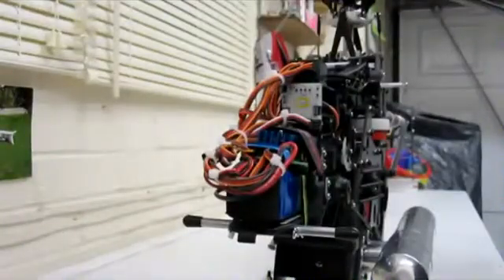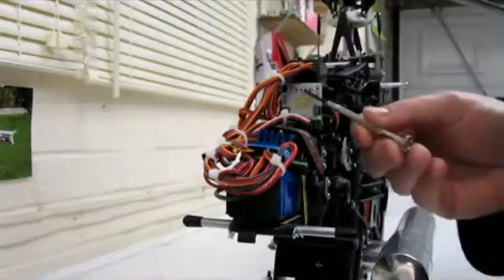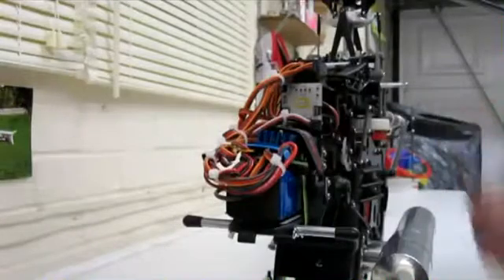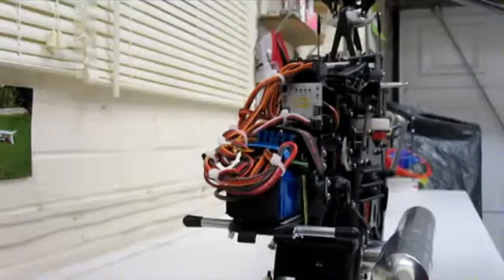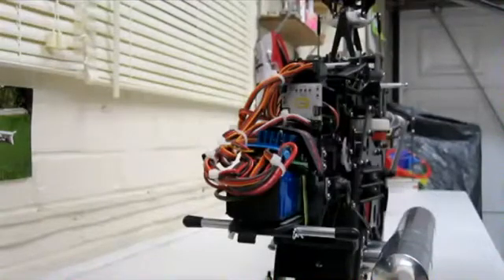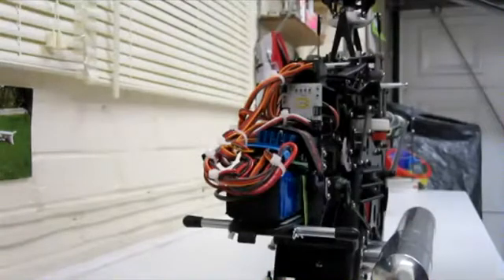As with everything with the model helicopter, when you first get the RevLock and turn it on, these lights will be cycling and flicking across. This one I've already used, so that won't happen because it's already had a programming set. But I'm going to go back through the initial setup. On the initial setup it asks you three questions: it needs to know where your tick-over stick position is, where your high-end stick position is, and whether you're using a digital servo or an analogue servo. I'll very quickly explain how this happens.